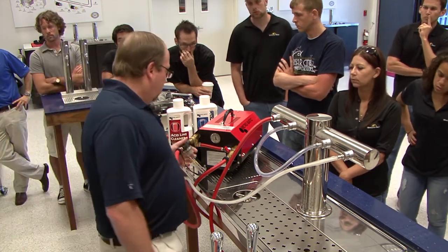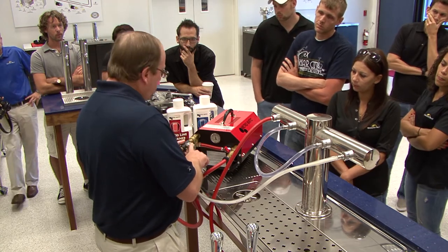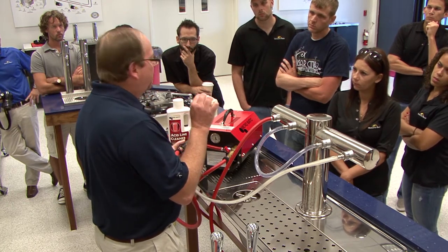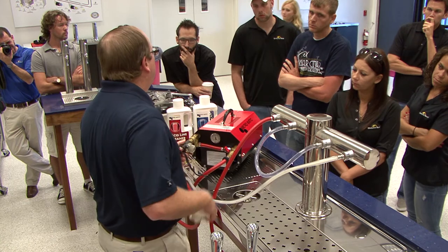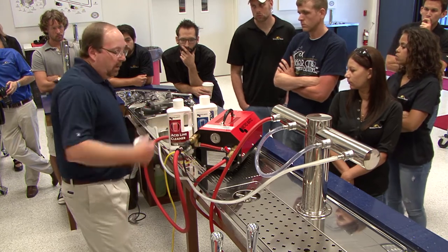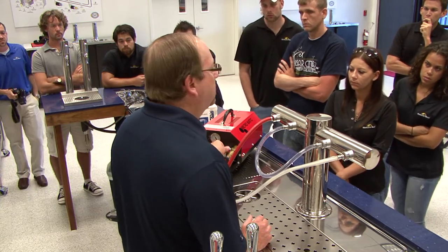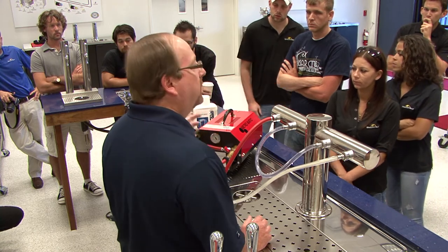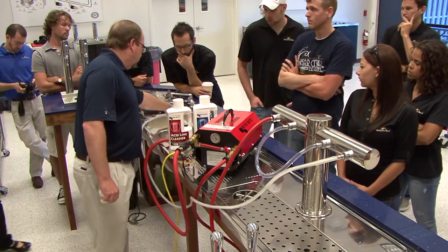We also have on this pump a screen — this is a removable filter that you have to clean out every once in a while. We recommend once every two weeks that you remove this cap. You'll see that that screen is really super fine in there. Basically that keeps sediment and the crud that you're cleaning out from going back through the pump again. We have a screen on the suction side, and also a really fine screen before it goes into the machine. On the front there's a little gate valve — that's how we adjust pressure on the pump. Open it up further, you get more flow; close it off, you get less flow.